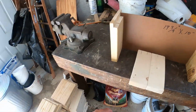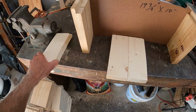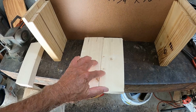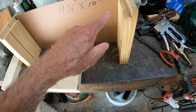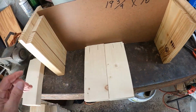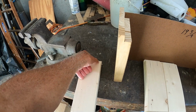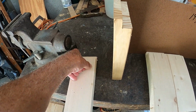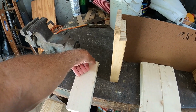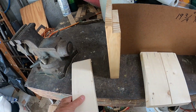I come back and I can take one of these, set up my saw. I don't have enough room here for five. With these two here, that gives you 7 inches. I need a little more space here. A little bit more. That's only 7 inches. I need 7 1/4. So what I'll probably do is come back and burn myself about, I don't know, maybe a half inch. If I had a little more slop on these boxes, fine. I'll probably burn a half an inch on my table saw.